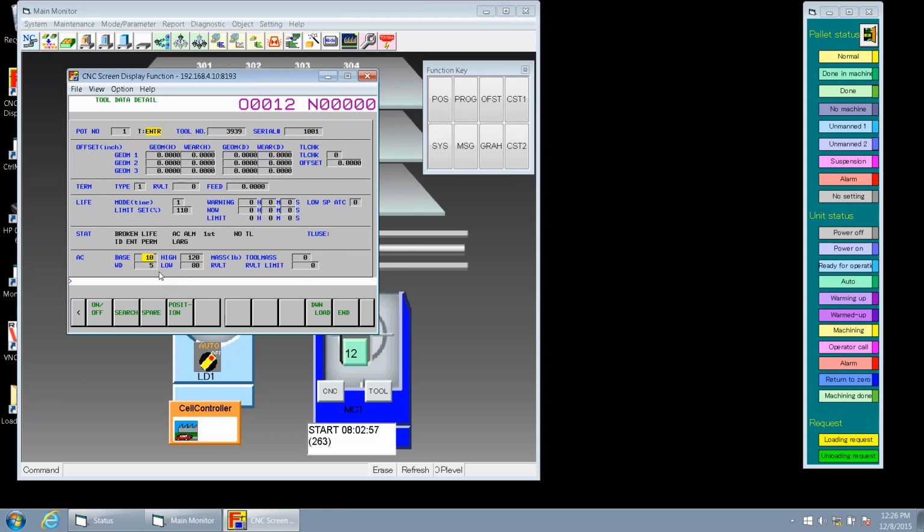So now we come over to high. So if it doesn't sense a spindle load, it would be down in the 5%. So we told it that we could overwrite and go up to 120% feed rate. Come down to the low, and if we had a load on it and it gets above the 15%, to try to slow it down and keep it in cut.